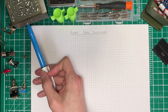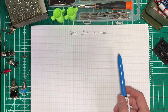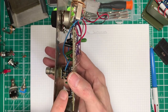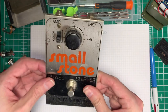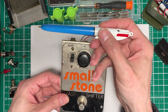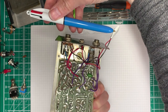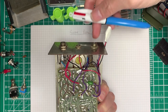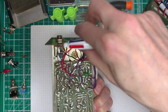So now let's have a look at the switching in this vintage Electro-Harmonix pedal versus the switching in this newer Electro-Harmonix pedal, and look at some diagrams that show you how those switches work. We saw earlier in this pedal there's just a single pole dual throw switch - so it's got three terminals. Now before I continue, you'll note that the instrument input is on that side and the amplifier output is on that side, so your signal flows through this pedal in this direction. However, when we're working on pedals we tend to have them upside down, so we tend to draw the circuit diagrams from left to right - this is your input and this is your output.